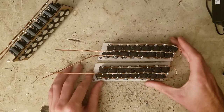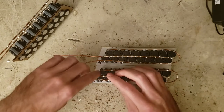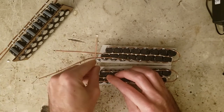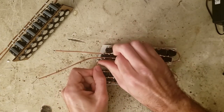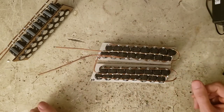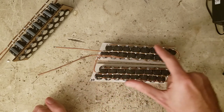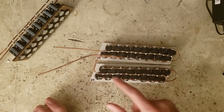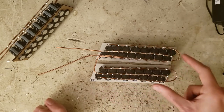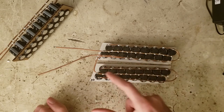I can stack them sideways, all facing the same direction, and connect the anode from this one to the cathode from this one. And then do the same thing up here with the next one. But look at this long wire path from here all the way around and then around again. That long wire path has a pretty significant resistance, and long meandering paths have significant inductance.